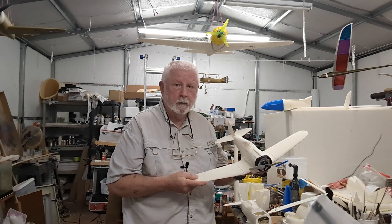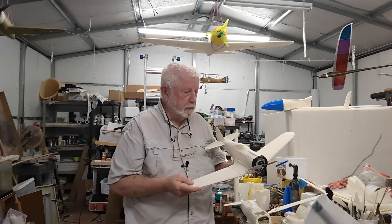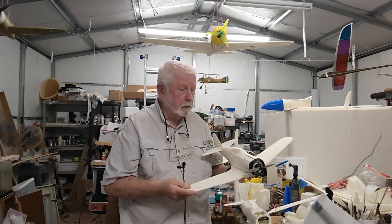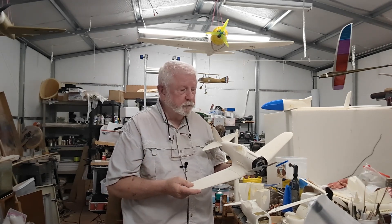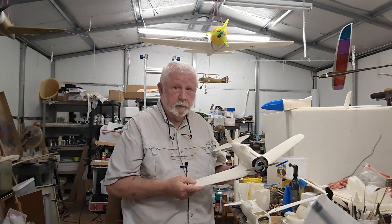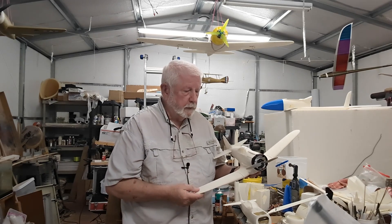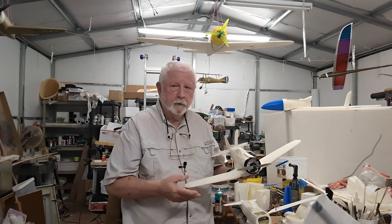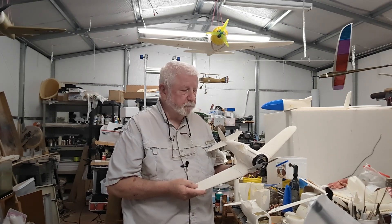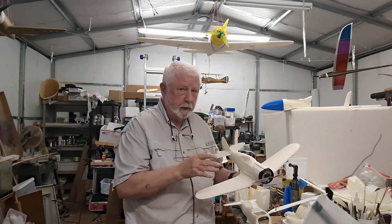This is done in a filament called Lightweight PLA. This particular filament is E-Sun — that's little E, capital S, U-N — and it's available on Amazon. The stuff is about $40 a spool for a 1-kilogram spool, but that's actually pretty inexpensive because this stuff actually foams as it prints. So that $40 per kilogram price works out to about half that in actual printed parts. With an extrusion multiplier of 1, which you'd use with most PLAs or PETG filaments, you'd get a certain amount of plastic out of the nozzle. With Lightweight PLA, you can turn that extrusion multiplier down to half or less.